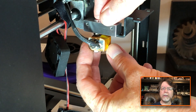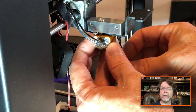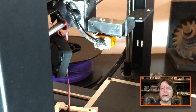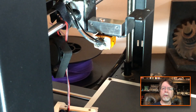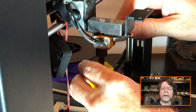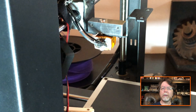Now you can attach the cooling block back to the carriage. Slide it into place and then get the two original screws and tighten those down. With those tightened down, we're going to turn the printer back on and heat the nozzle again — to about 240 degrees. Once it's up to temperature, grab the heater block with the crescent wrench and tighten the nozzle back down using that nine millimeter driver. Now we can turn the printer off and let everything cool down again.